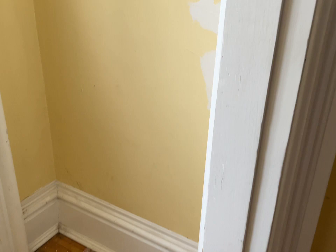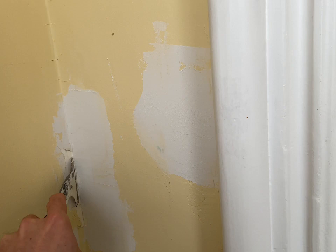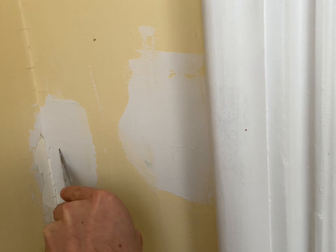You can already see I'm starting to make a mess. I had done some patching earlier, but there was still some loose paint that the patch didn't bond to, so we're just going to scrape all that off and start over. Plaster is cheap, so I'd rather have a good finished product. Everything's pretty smooth up there, there's a little bit of patching to do, and some paint failure there that I got to scrape off.